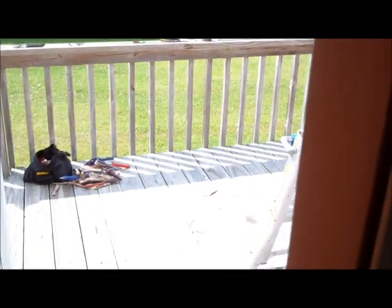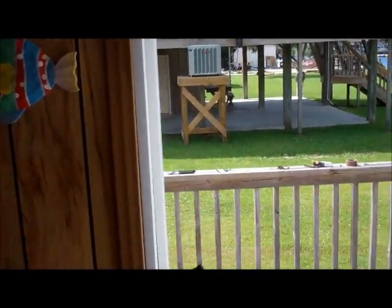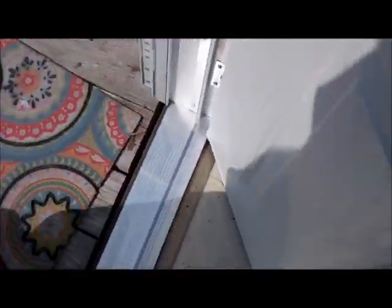The only other thing I'm worried about when I do that is that the door at the top then hits the door jamb on the top, and we jack it up and we only have a quarter of an inch. If that happens and the door's still not fully functional, we'll have to jack this side of the house up, which will bring this side up again. We don't want the bottom plate to be up off the floor — we want that to be solid, so that every time you walk across it you don't have that thing dipping down and eventually it just breaks.